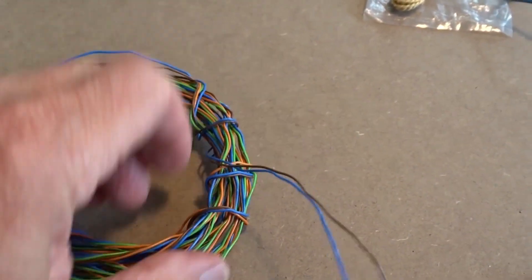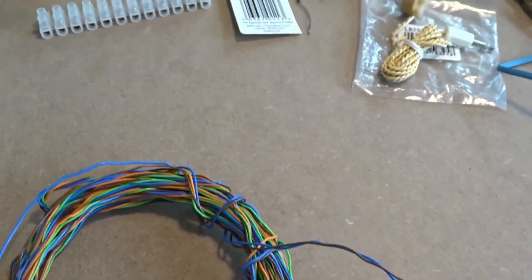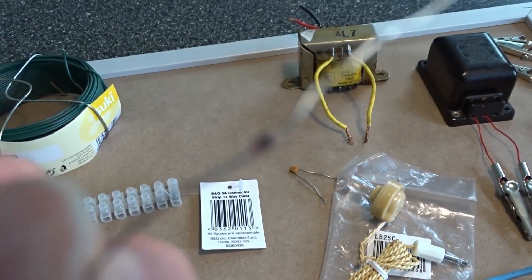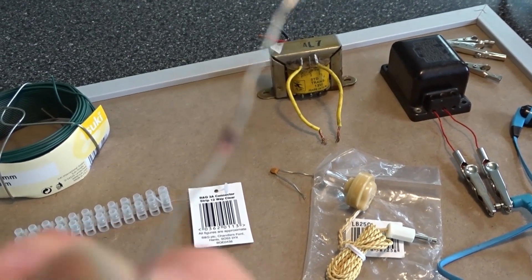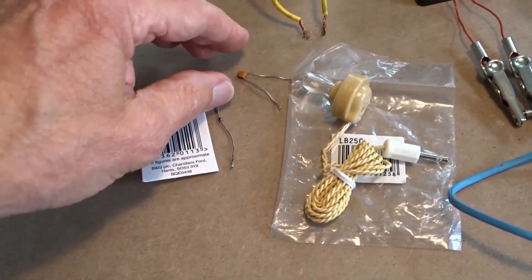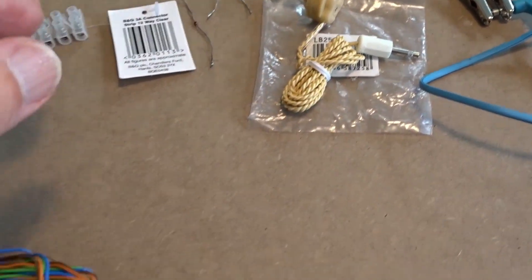This wire here is just for hooking up stuff — it's thin telephone wire, the kind you'd use for running a cable out to an outhouse. I strip this back to get the thin wire just for connections. Another important component is a diode — specifically a detector diode. The one I have here is called a Schottky diode. There are many versions of this. There's also a small capacitor here which isn't absolutely essential but does help things a bit.